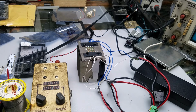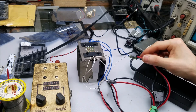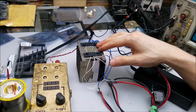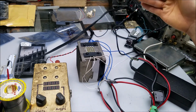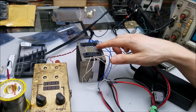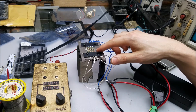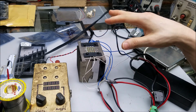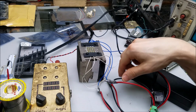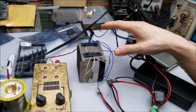So, as I mentioned in the beginning of this video, there is a special project that I want to do later on this fall, which will involve using 4 of these buck mode power supplies. And I have here a test array that will mimic the load I want to drive. On the test array, there's 20 high-powered red LEDs. There's 4 groups of 5 in series, and each one of those strings will have a current of 1.6 amps coming from the driver. So each string gets 1.6 amps, 4 strings.